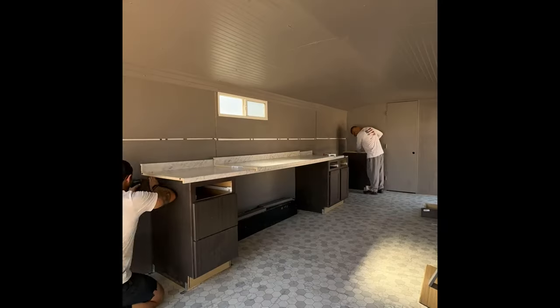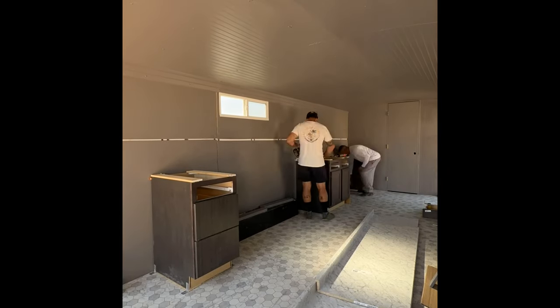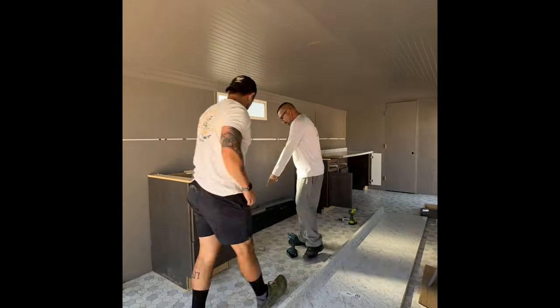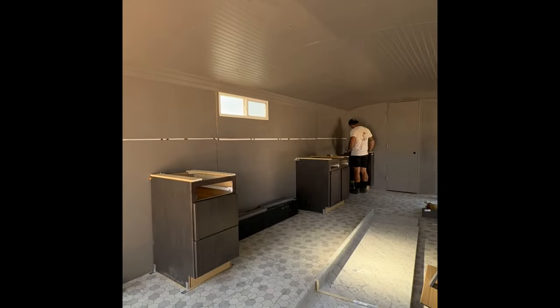Pro tip: if you go with drop-in countertops and a laminate countertop, glue alone will not work. In the mobile industry, you have to back up every glue with a screw. Every type of glue needs some type of mechanical attachment so that you have two sources of attachment to keep everything secure. Remember — you are bumping up and down the road and experiencing a lot of hot and cold fluctuations, so glues without screws don't last very long.